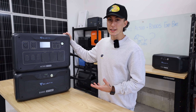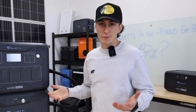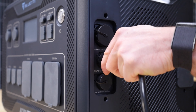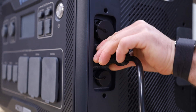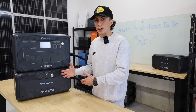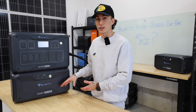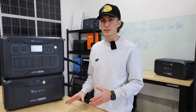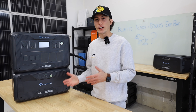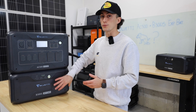It has a 5,000 watt AC input and also a 3,000 watt solar input, which is medium — in 2024 that's medium. But 3,000 watts of solar is actually a perfectly matched number to the 3,000 watt-hour battery size. Every hour of 3,000 watts you're putting in charges one battery, so with three batteries you can fully charge your system in three hours. While it doesn't sound like a lot, it is actually a well-matched number.